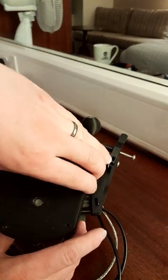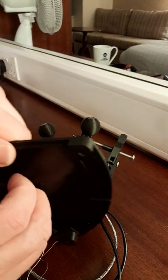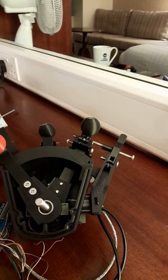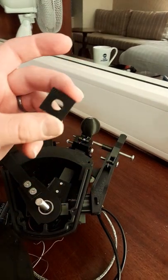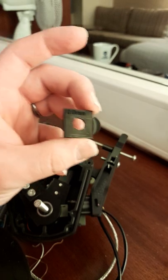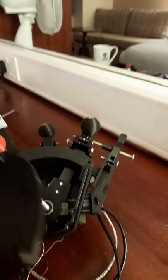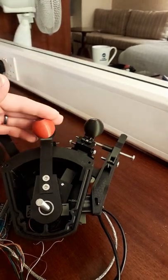And this front cover lifts off, and we'll see one of the features I've built in now, these. Because when you print things, especially in the Z direction, it tends to lose a bit of height and alter a bit. So this one, can you catch that in the light so you can see it? There you go. So each one's marked. There's a whole set of these up to about 0.4 or 0.5, so you can adjust the whole stack and shim all the levers to fit in just right.